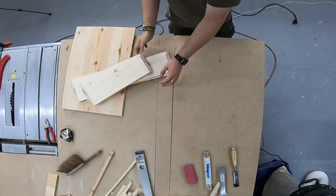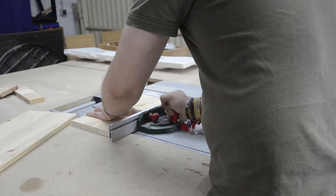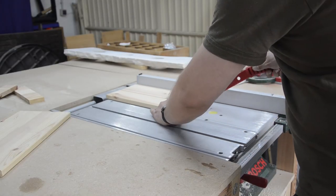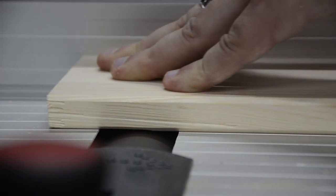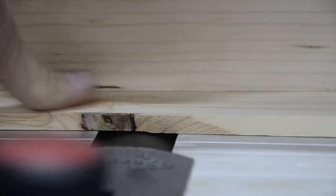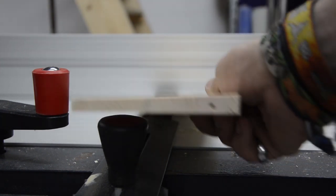Now the insert bottoms are still missing. They should be relatively thin, so they must be planed often. Here you can see what happens when you try to do the work of a thickness planer on a surface planer. The board becomes wedge-shaped, but the thickness planer will straighten it out.